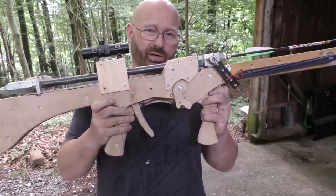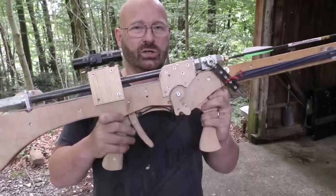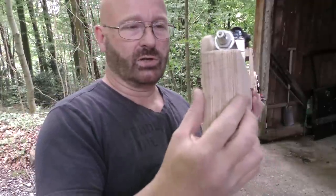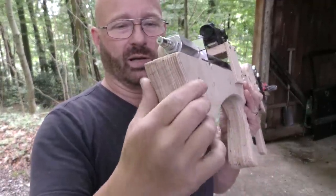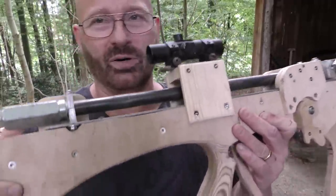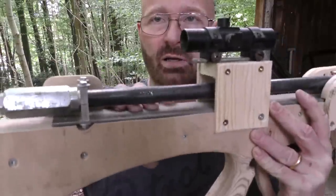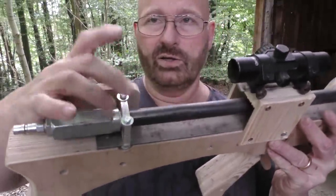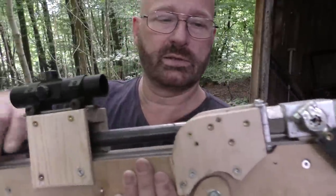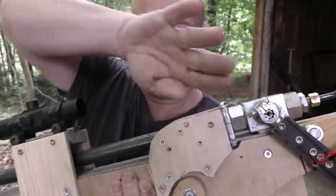It's not designed to be pretty. I like making pretty things, but this is pure functionality. It is actually solving all the issues I had with the previous model from last year. The stock is made from three layers of 18mm plywood, giving it a total thickness of 54mm. I mounted it onto a stainless steel flat iron part and used metal brackets this time, and I came up with a method to support the metal brackets from the recoil of the barrel that wants to shift the whole thing back.